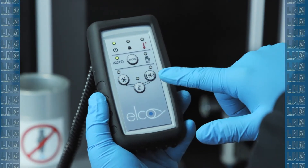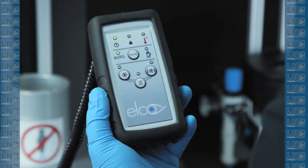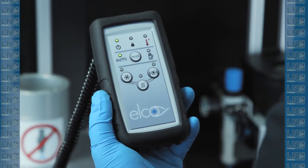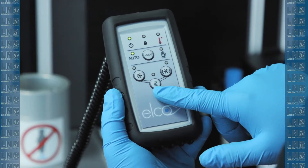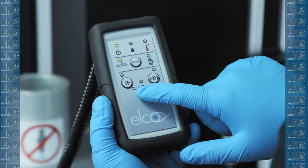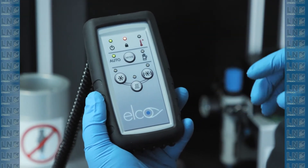Next is the cooling buttons. There are two buttons because the Stark II unit is capable of holding two air cooling units. Only one is sold with the unit, but you can buy an additional one if you have a high volume of shrink fit tools. The middle button is the heating button. If you press this button, the shrink fit unit will start heating the tool, and it will lock out when enough heat is applied.